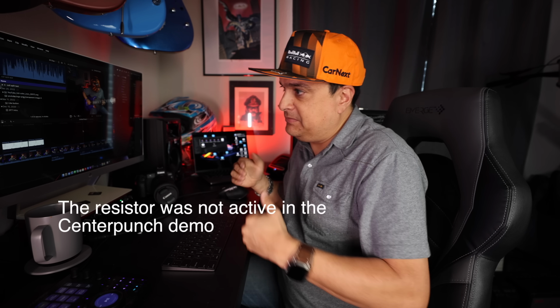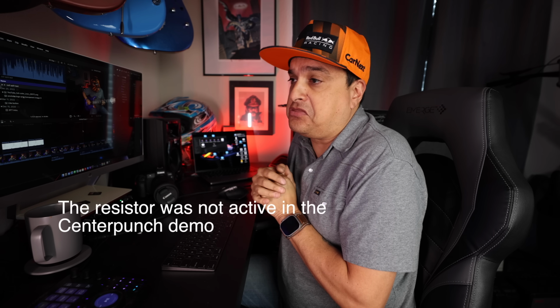And I don't know if you noticed it, but in the dirty part, or even if you played this slightly broken up, like through a Princeton, for example, that perception goes away even more. So going from an 8 dB drop with a coil split to a 2 dB drop with a coil split, which is a third, to our ears is a massive, massive difference. This is much more tonally useful in a lot more circumstances.